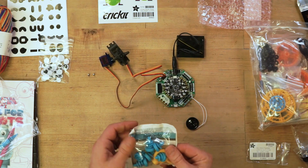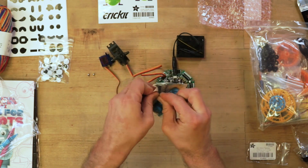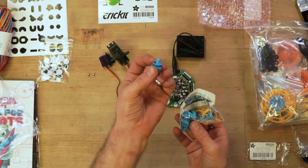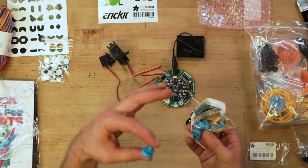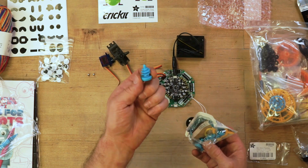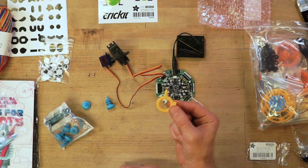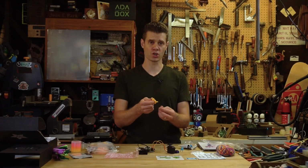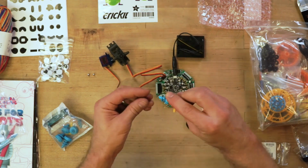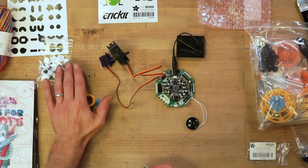We've also got in here this great little packet of make-do screws. These are a couple of different sizes of these little screws that you can use to connect cardboard. And you can actually take some fairly thick cardboard, a couple of layers of your standard corrugated cardboard that you find in most shipping boxes, and connect it with the short screws, and then multiple plies beyond that, or thicker cardboard with these long ones. And these are pretty cool because they're easy to work with just using this little tool that comes in the bag. So you can punch your hole through the cardboard and then turn around and use this side of the tool to connect to the little hex drive and twist that into place. So these are really cool, and you get a nice little set of those to get you started.